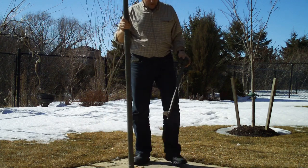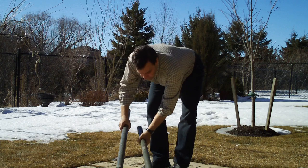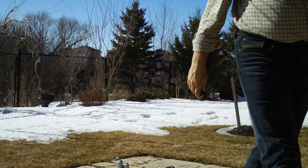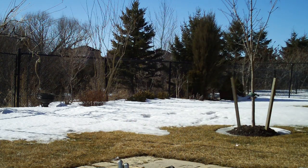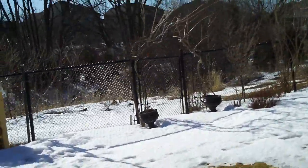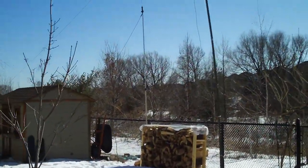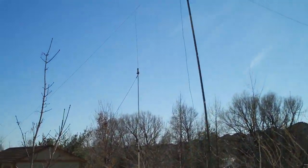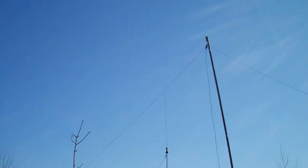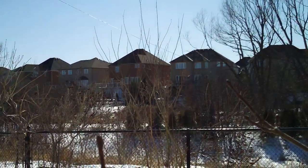It's a 40-meter antenna, 28 feet long. You'll probably look at it and ask yourself why I didn't guy it — and I didn't. I put it together last night in the dark, which gives you an indication of how easy it was to put up. There are seven elements: seven times four is 28 feet. It worked out pretty well to put up a 40-meter dipole.